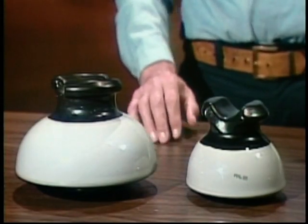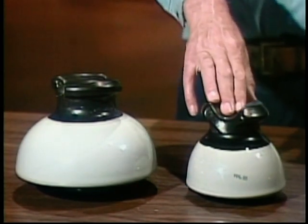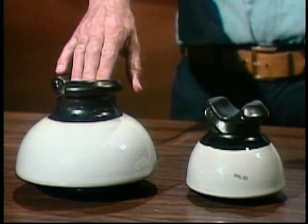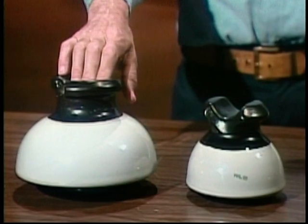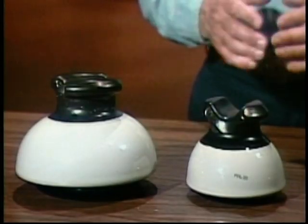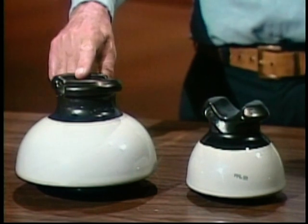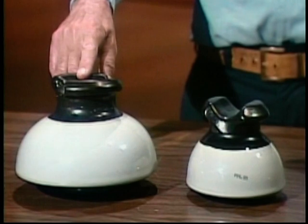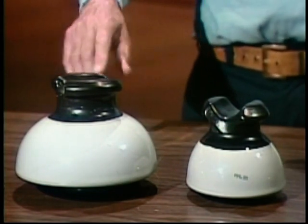For example, here's an insulator that one company may use on their 13.2 kV distribution circuits, and here's one they may use on their 34.5 kV distribution circuits. But insulators are not always a surefire way of identifying a circuit — the same company that uses this insulator on their 34.5 kV circuits may use it on one of their 13.2 kV circuits, especially if they're going to convert that circuit to 34.5 kV sometime in the future. Besides coming in different sizes, insulators also come in different shapes depending on how the insulator is used.